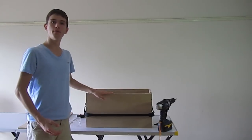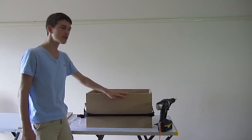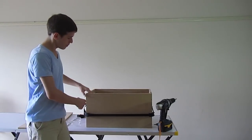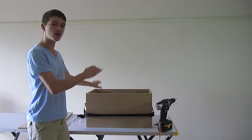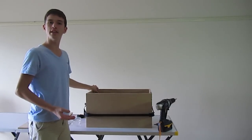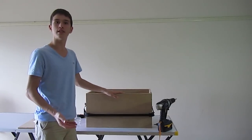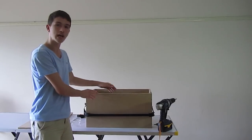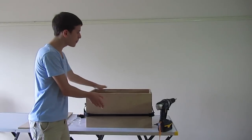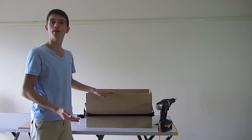So that's one screw done. Now what we want to do is pilot hole, countersink and screw together the front and back of the box. Then we want to flip the box upside down so any uneven edges will be at the bottom and unseen. Then we want to do the same thing — pilot hole, countersink and screw the base onto the box, and the box will be completed.